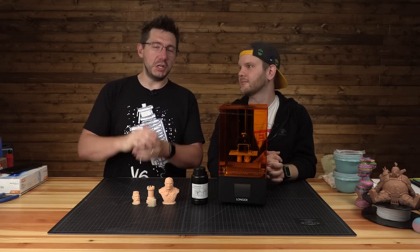I want to make sure you understand: resin-based 3D printing is messy, gross, and dangerous. You don't want to get that resin on your skin. You'll see Sean and I use gloves — you should use nitrile gloves as well. Ventilation in the area is very important; you don't want to be huffing resin fumes all the time. Low-cost resin 3D printing is fantastic — be safe, and watch out for the future as you don't know the longevity of these machines.